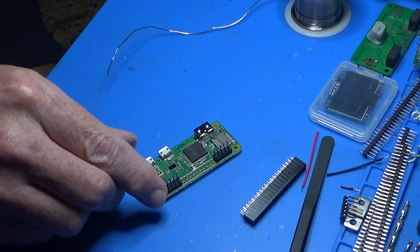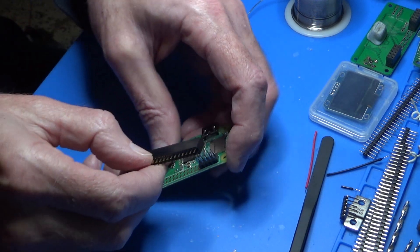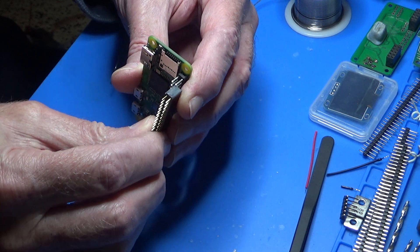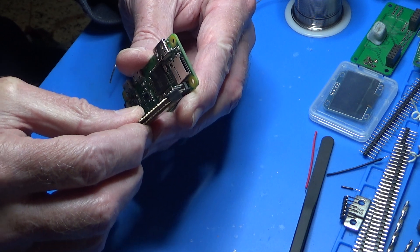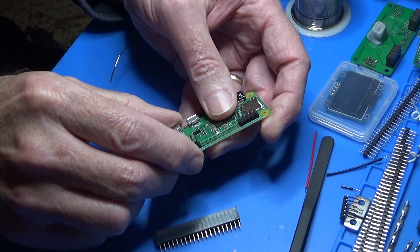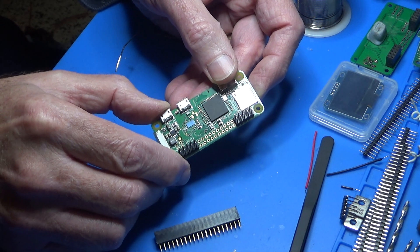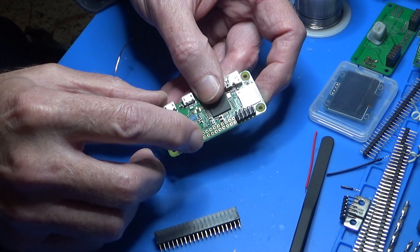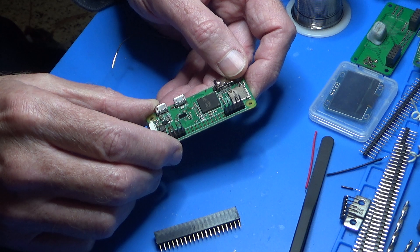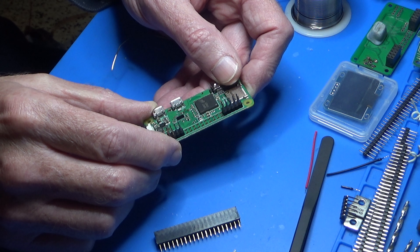So that's pretty much it. I think putting them into either a full pin header like so — if you're going to solder the full 40-pin GPIO, you'd want to put that on and join them up. But otherwise, if you're using it for a hotspot or a modem board, then doing it the way I showed you is certainly the best way to do it. That's the way I do it — I'm not saying that's the only way, but that's the way I've figured out how to do it over the years.